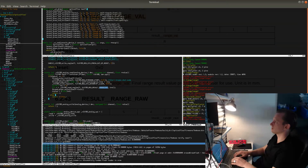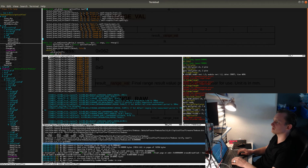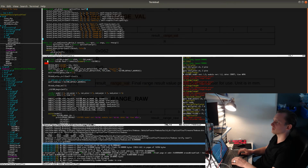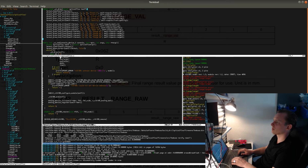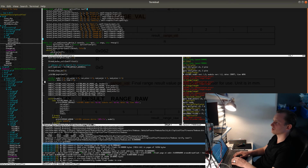And the indicators will be floats. Let's see. Okay, it's the moment of truth, and no sensor works. Yeah. Only one of them works. I think this is related to the address. Somehow, yeah. I think it's both related to the address and the fact that I didn't disable this. Let's see. There is this GPIO 0 pin, which enables the chip. So I shouldn't be doing this. I shouldn't be doing it there. I should just enable the chip.